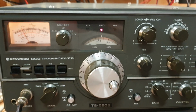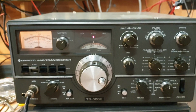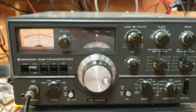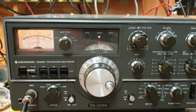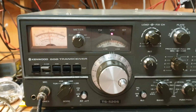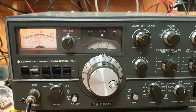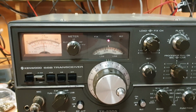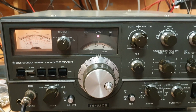Go ahead. VK3 Charlie Mike, YJ0CA. Yeah, Brendan, hearing you quite easily. You're sort of S9 plus a little bit. You're kidding. To copy over the noise, background noise is sort of about 7. No amplifier, see? So easily copied. And not quite mobile, okay, with a mobile whip. So what's the antenna actually running against? Is it actually on the shed, or are you using some radials? Yeah, you're correct. It's just coming off the shed.